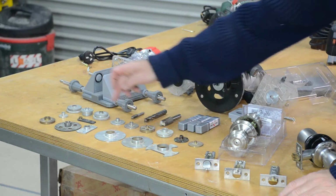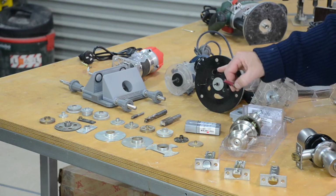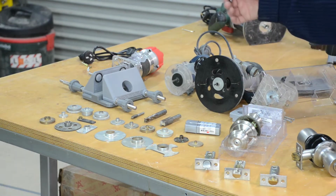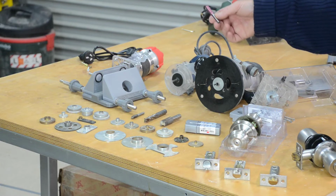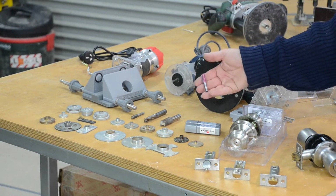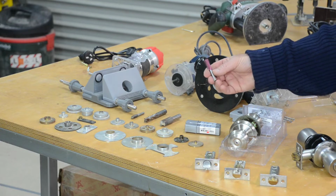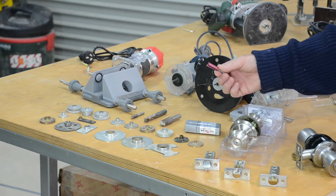Here you can see many different kinds of template guide. Now the common shank sizes for routers here in Australia are based on inches still. A collet which gives you either 6mm or 1/4 inch or 8mm. 8mm and 5/16 are very similar measurements, so often one will do for the other. But these happen to be a 1/4 inch shank, these cutters, but they are a metric cutter size. And I suspect wherever you are in the world you'll be able to get a combination of whatever shank size you need and whatever cutter size you need.